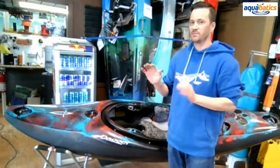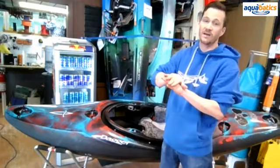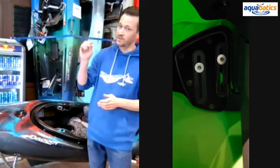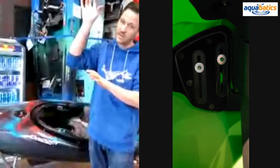Once taking that off, slid it back, then you want to adjust those plates you're talking about that eliminate that foot entrapment issue. So there they are there. Really easy. You're basically going to loosen those 2 bolts, get your hands in, and just separate the 2 with your hands. You basically have to push that top one up into the top of the boat, pull the bottom one down. Crank them as hard as you can so that they're really filling up the whole void.